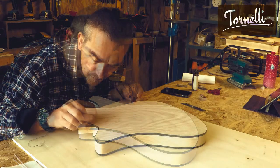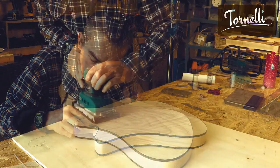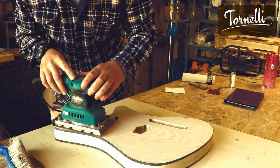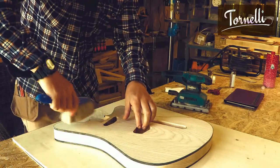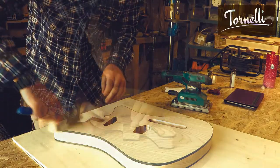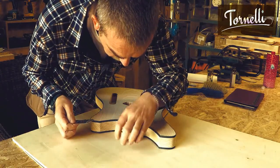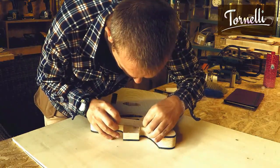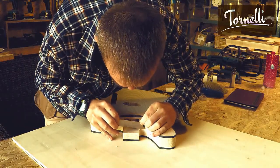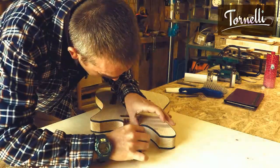The best way to apply the filler is with the needle so you can push it right down into any gaps, and just leave the filler slightly proud of the surface because it's quick to come back with a sander and level it off. Once I've sanded down all the filled areas I give it a good brush off and have a really good look around the binding to make sure there are no hairline gaps or bits I've missed. The last thing to do is revisit the neck pocket just to tidy that up and make sure everything's perfect. And that's how I do my binding - I've put in a few close-up pictures so you can see what the finished binding looks like. Thanks very much for watching.